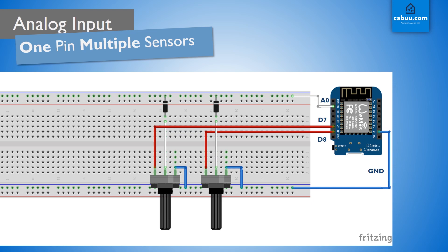Normally, we would connect the positive pin of the potentiometer to a positive terminal, such as the 5V pin, but in this case we want to be able to control when power is provided to it, so we use the signal provided by the digital pins — one for each potentiometer. In this case, we will be using pins D7 and D8.